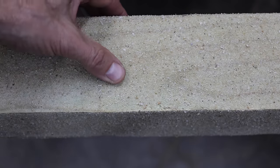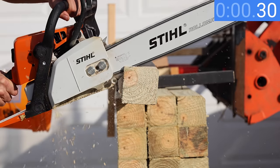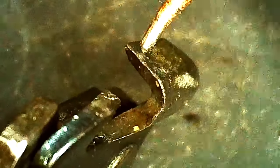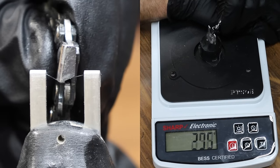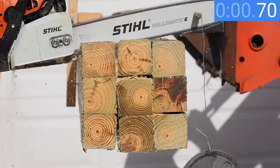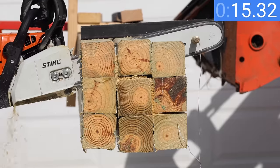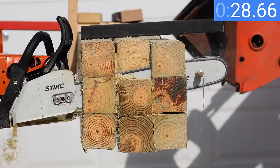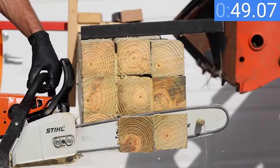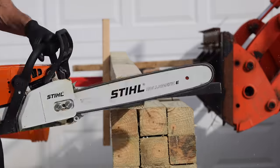Let's go ahead and dull the chains by cutting through a board that has sand glued to it. The chain made the first cut in 1.5 seconds, but slowed to about 3 seconds by the third cut. A close look under the microscope confirms this chain is in very bad shape and extremely dull. The sharpness score is now 880 — that chain needs some help. Running the dull chain through the test log, it finished in 50 seconds, which is absolutely awful. It didn't take long to dull $200 of chainsaw chains.